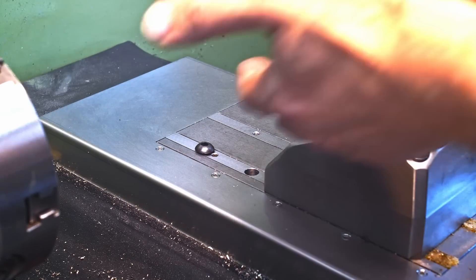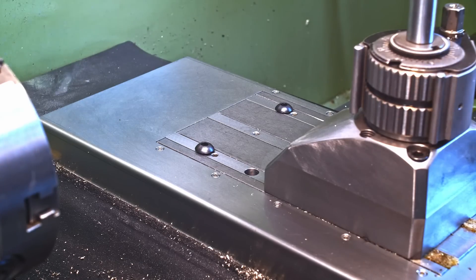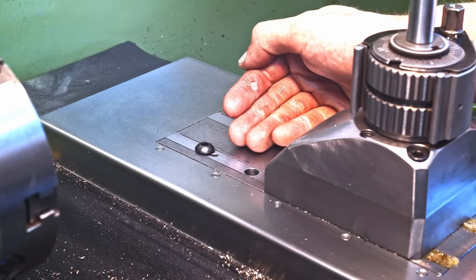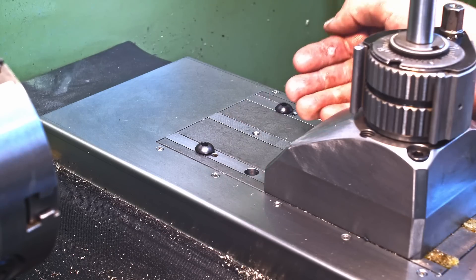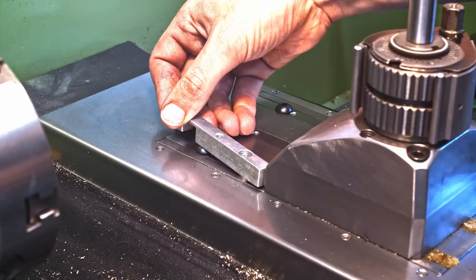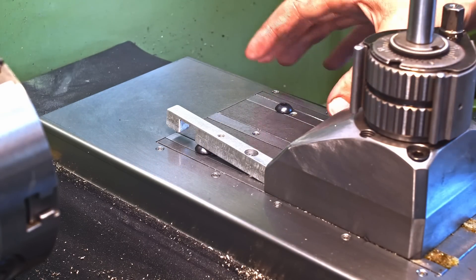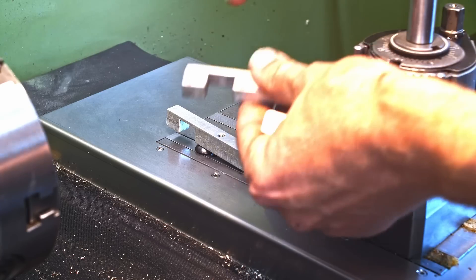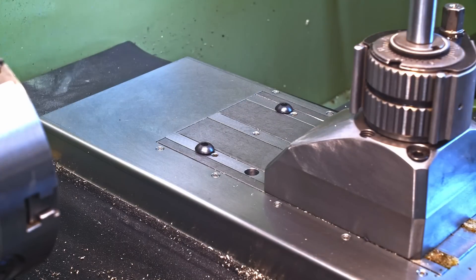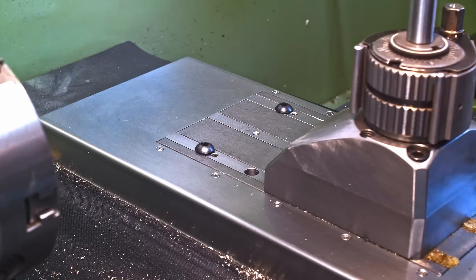While on the topic of working with the solid tool post for drilling — I also had to change my workflow a little bit because recently I had to do quite a bit of taper turning and also diamond turning using the compound slide. That meant putting the compound slide back behind the solid tool post. I had aluminum T-slot covers in there and T-nuts to mount the compound slide, but pulling those out, cleaning everything, and putting the compound on was quite a bit more effort than I was willing to do regularly.